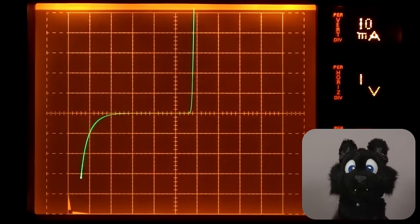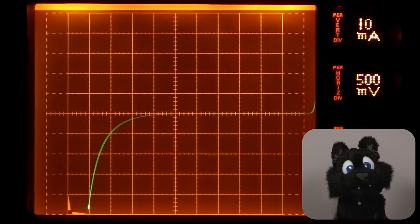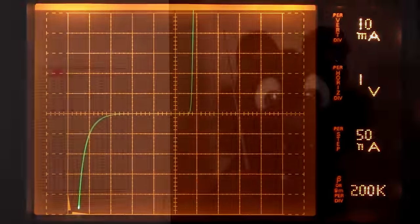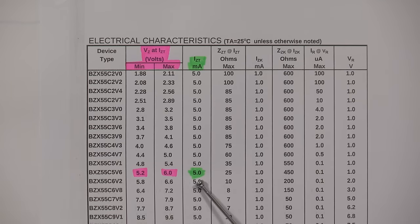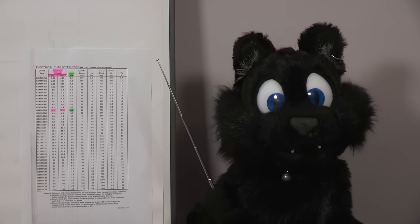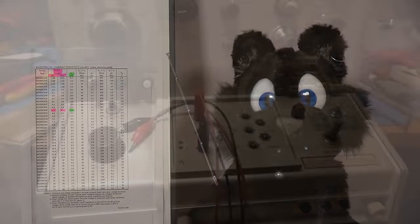And here we have a Zener diode. As you can see, the Zener effect has a rather large knee, which means that the diode will conduct quite a bit when it's close to the nominal voltage already. Which is why the datasheet will list the nominal voltage at a specific current, and if you really want to regulate voltages with one, you need to provide a regulated current into it so that the voltage output is as precise as possible.